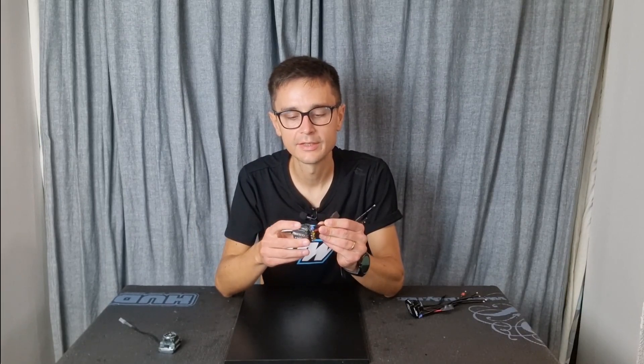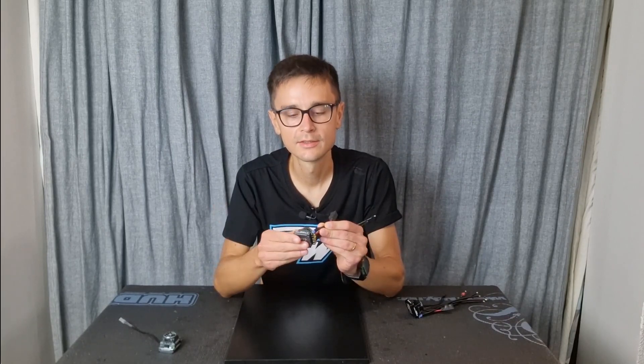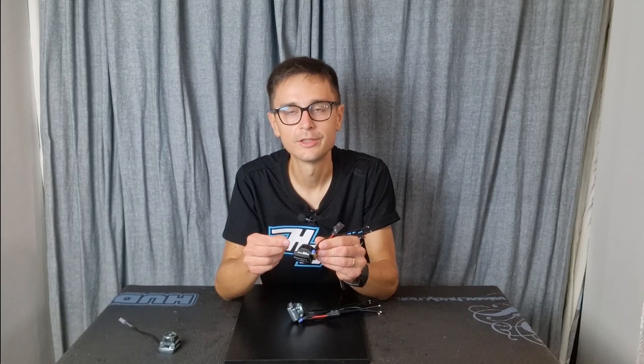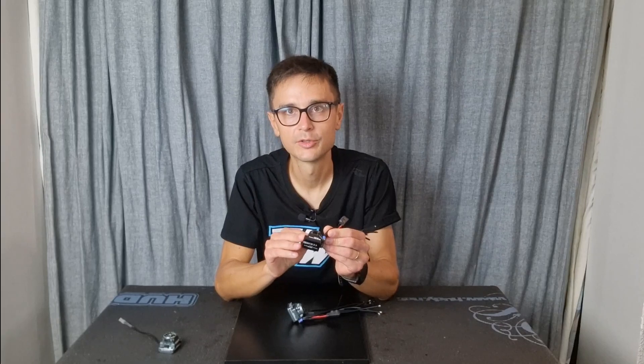A lot of customers asked about the differences between the two versions. You have the gray version which is called the G3X, which is mainly recommended for stock classes. The reason is that the G3X doesn't have the reverse polarity protection built in anymore, which helps performance in stock classes — so be careful when you plug it in. The black version, however, still has the reverse polarity protection, though unless you run the optional reverse polarity capacitor, the capacitor can still break from plugging in the battery backwards.